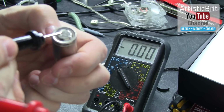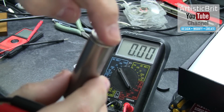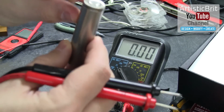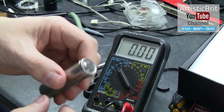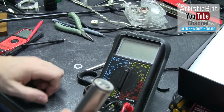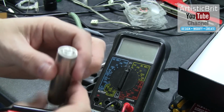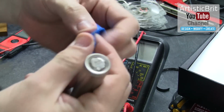So you need to be really careful in the wiring and where the wires rest, because if they're connecting on top and they're laying flat and they're breaking through the plastic, you're going to have a short. Or a fire, and if you've got this thing between your legs as you're riding along on your bicycle, that's not going to be good. So I've decided to take some extra precaution and cover these in some shrink wrap tubing. Actually, I think it's just standard tubing, but it should give much heftier protection than this flimsy stuff.